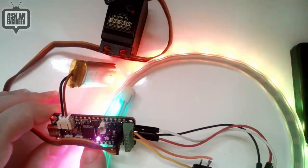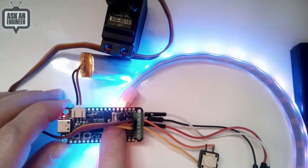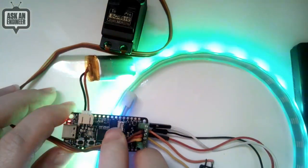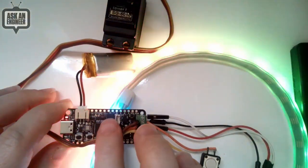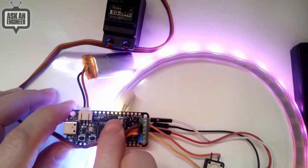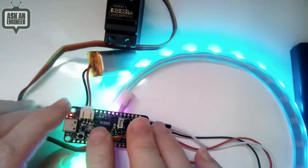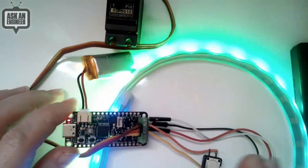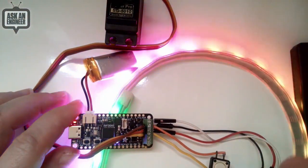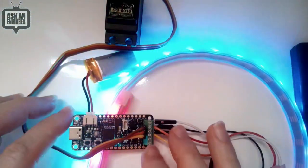And then this boot button here, when I press it, it turns this LED white. And of course, you can add more sensors and capability over the STEMMA QT port. Just plug in vertically into it. This one has a broken connector because it's mine. But imagine it didn't have a crack in it. Plug in a gyroscope. You can plug in OLEDs. You can plug in more servo drivers. You can plug in an NFC RFID reader, whatever you want, into the I2C. And of course, you have all the header pins as well. So you have like 21 GPIO on top of that for any kind of analog reading or digital control, connect to a TFT, what have you.